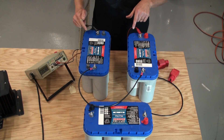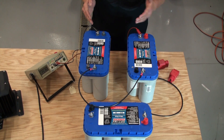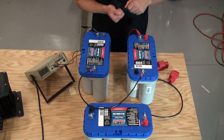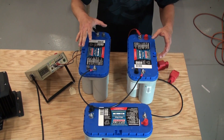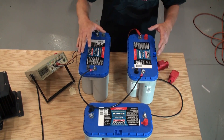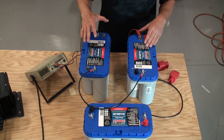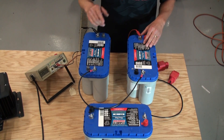The 24 volts come in at the negative side of battery one and the positive side of battery two. In a tight compartment, you want battery one's negative or positive and battery two's negative or positive both at the front — that's where your cables come out of the boat. You don't want wires crisscrossing and making your compartment look like a big mess. That's the 24 volt system.